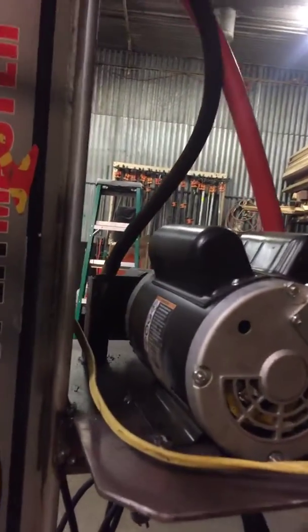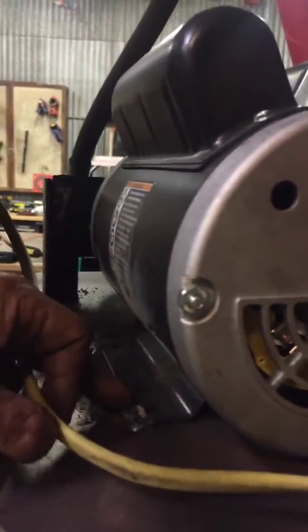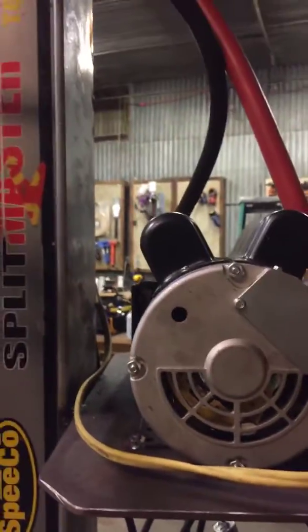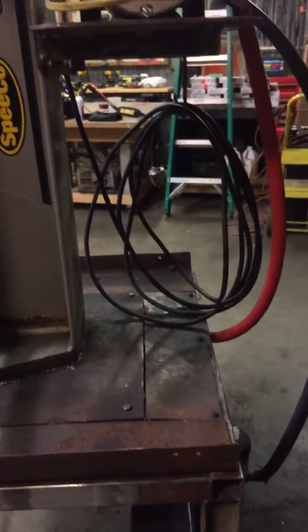Tank is down below. It is mounted securely. There is the motor mount, welded on some flat plate up underneath here. That way with a piece of angle. Had the 1/4 inch laying around. The motor is actually welded. There's like some little tabs here that you just cut if the motor blows, and spend another $160. So really, that's about it.